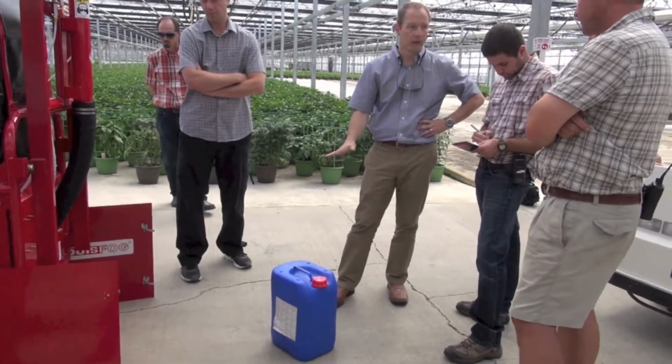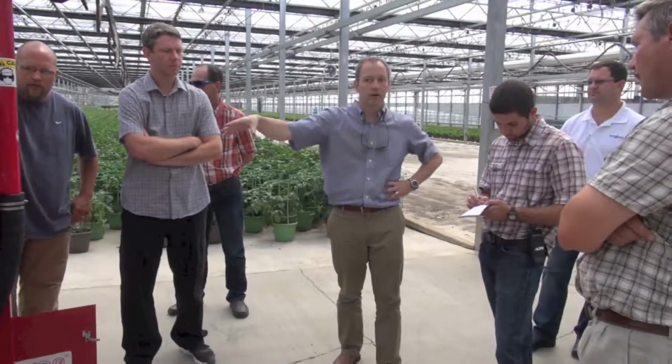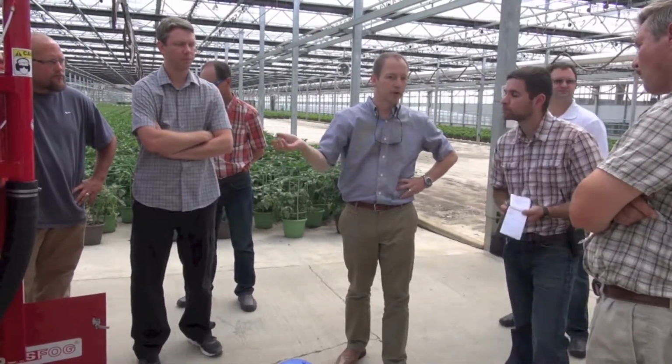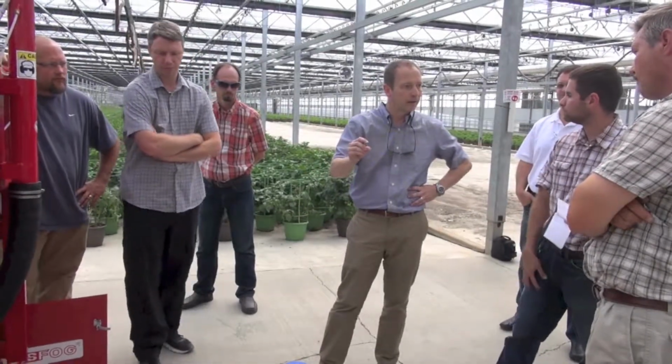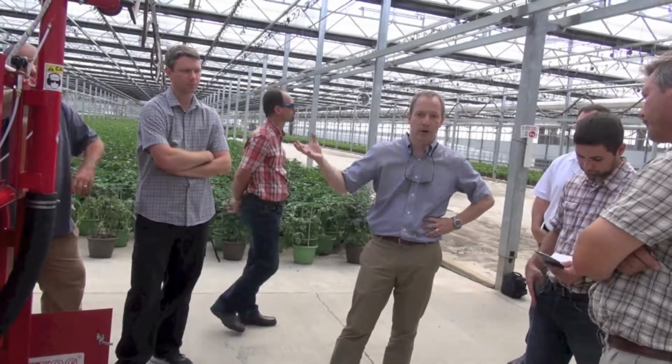That's the minimum now. There's going to be products that you're going to find that are a little more stubborn. They don't mix as well, because of the concentration we're going to make. We're going to put 8 liters total, 2 gallons of water, on an acre. For some pesticides, that's 100 gallons per acre of water that you would normally use. We're going to get away with a little less pesticide than you would use for that acre, but it's going to be pretty close to the same amount. So we're putting 100 gallons worth of pesticide into 2 gallons worth of water. That's going to end up being a much higher concentration, so solubility is always an issue.